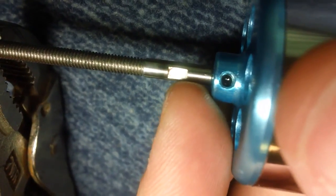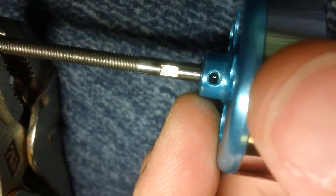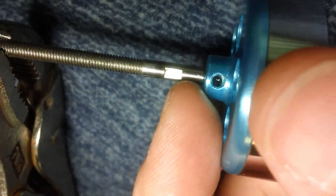What I'm going to do is take a Dremel and just deepen that notch — just the very front part of it, just slightly — just enough so that the grub screw will catch in that notch and it won't slide down farther and put pressure on the bearings.